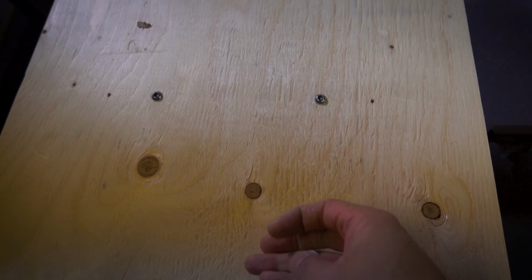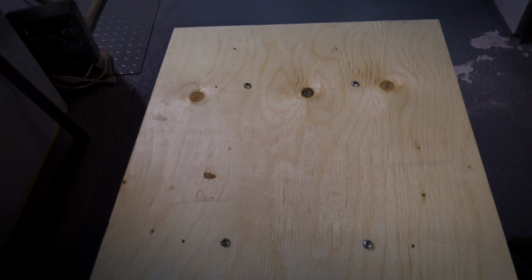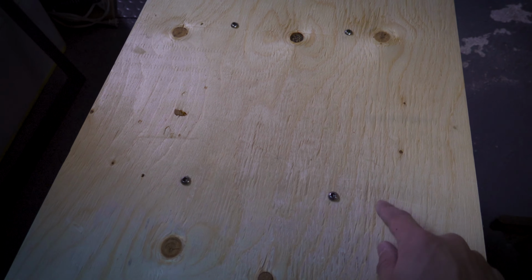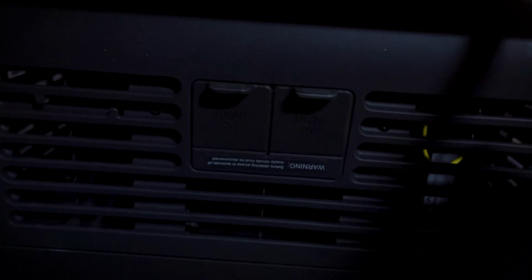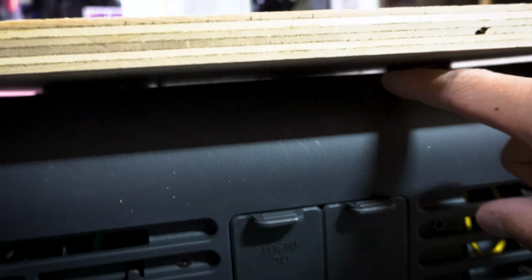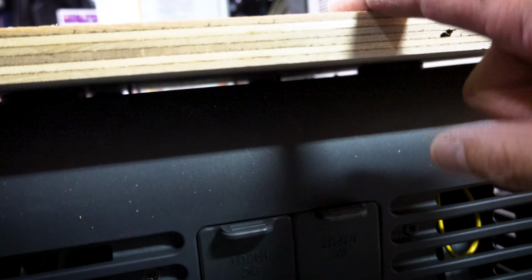These washers are gonna go in under there, and then it's going to countersink them, then drill out these 4 remainder leg holes with I think it was a 1 3/4 inch drill bit, and then the legs of the fridge will sit perfectly, and then this will sit flush with the fridge. Right now, I don't know if you can see it, there is about a quarter inch of space. So once I get those leg holes drilled, this will sit flush. So yeah, getting there, just a little bit further each time.